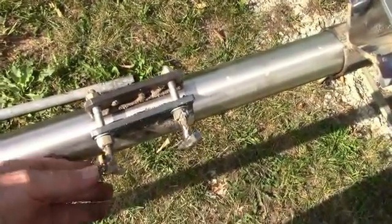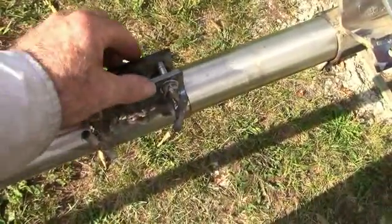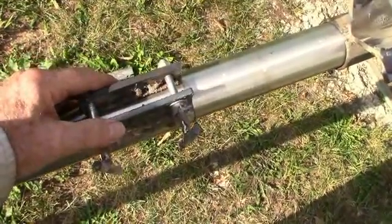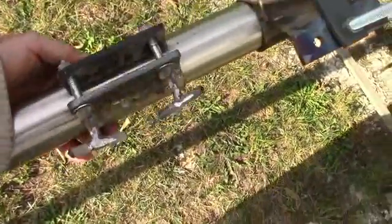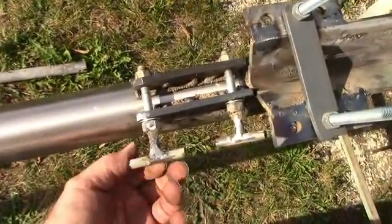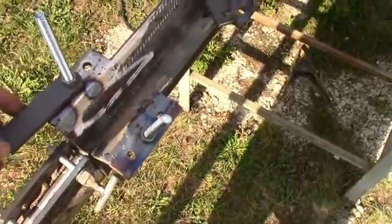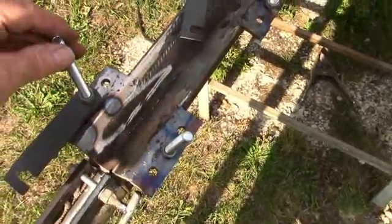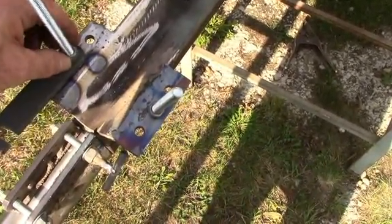Instead of pins I came up with something different. I took a piece of pipe and welded some pieces from the garage door opener spare junk, and made some T-handles. You can slide this up against the fixture, tighten these T-handles, and the pipe isn't going to slide. I need to cut these bolts off and put some type of handles on here, or I may just leave them and cut the bolts off — I can always tighten these with a wrench.